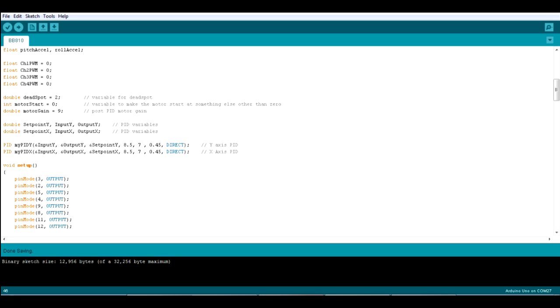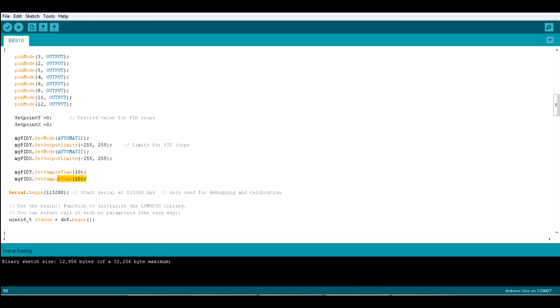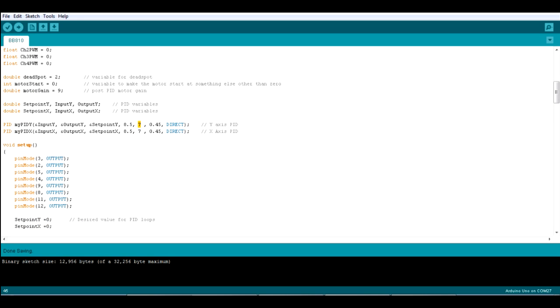I found out — thanks to the couple of people that told me — that the PID loop itself has its own set sample time parameter. The default is 200 milliseconds, which is only five times a second, and I didn't set that, so it was left at 200 milliseconds. I've now gone back into the code and set that to 10 milliseconds for each axis. Previously my integral setting was set to zero, and if I set it to any number it made the droid really unstable. I've now set that to quite a high value of seven. I've also trimmed down the dead spot to two degrees from three degrees, and tweaked the other variables on that PID loop. It's been much easier to tune up and the droid is much more stable.